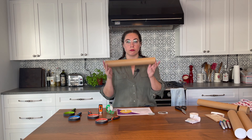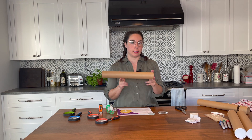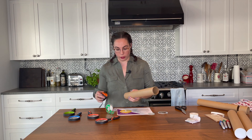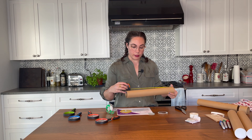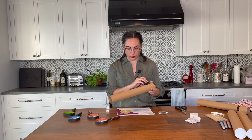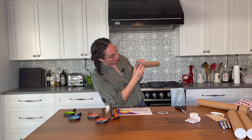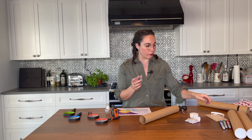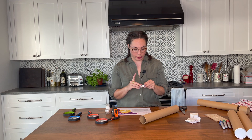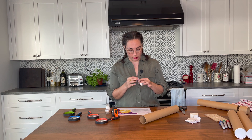Once you have that distance, you need to take your tube and secure your two lenses at roughly that same distance. This is a little bit tricky because you're gonna need to measure along the tube and then cut into it to be able to slot your lenses in. My lenses are a little bit tricky because this lens is smaller than the diameter of the tube, so if I just put it in it's gonna fall all the way through. So what I'm gonna do instead is wrap the outside of it with double-sided tape to make it more secure inside the barrel.